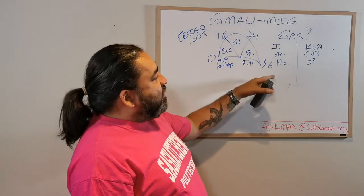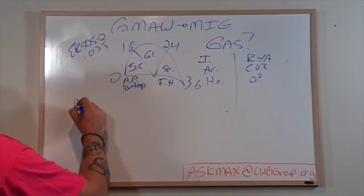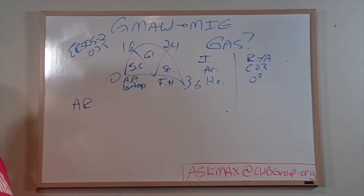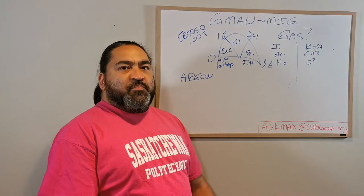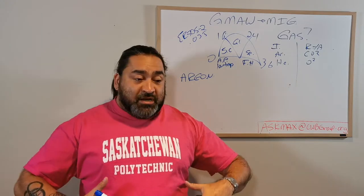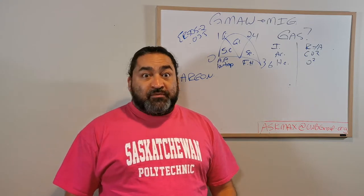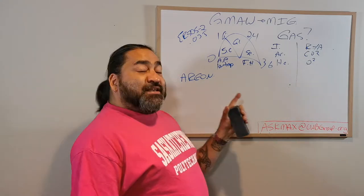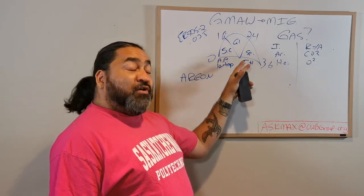Now, when I look at this, I'm going to have to think, what do I need? Well, let's start with the first gas that we always use, which is argon. Okay? Now, argon, we talked about it being like that bully gas, the big insulator. It comes in and it pushes things out of the way and creates a safe zone for welds to happen. Now, for that same reason, it's better at some components of welding than others.